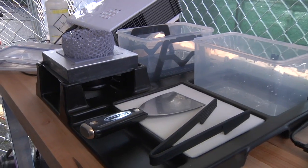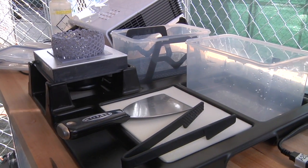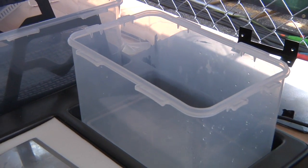How sturdy is the material after it's been cured? There's a post-processing step as well. As with any 3D printing process, there are some finishing steps needed to get the freshly printed part ready for use. Because our goal is to design the entire process — from software to machine to finishing steps — we've also designed a custom finishing tray and accessories package. You take the build platform off when your print is finished, put it in a jig in the tray, break the part off its support structures, and then dip it in little baths of isopropyl alcohol and water using a rinsing basket to finish the part up.